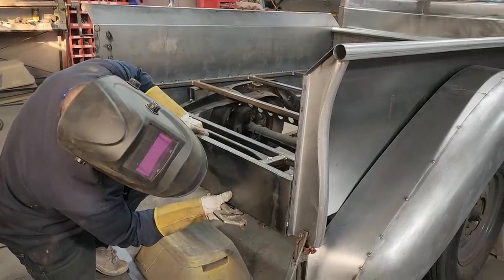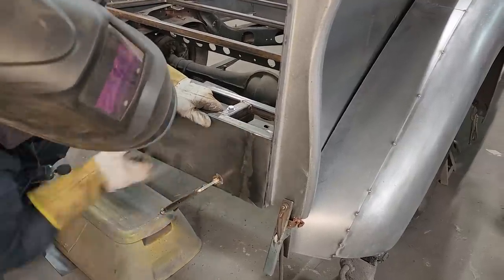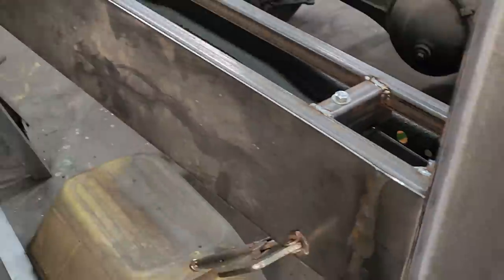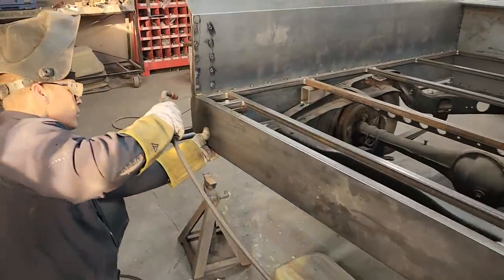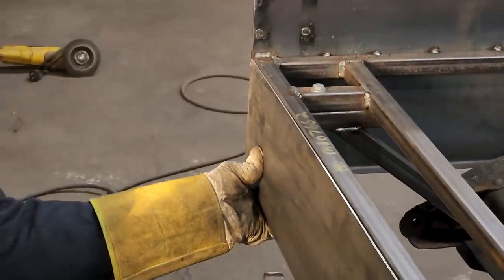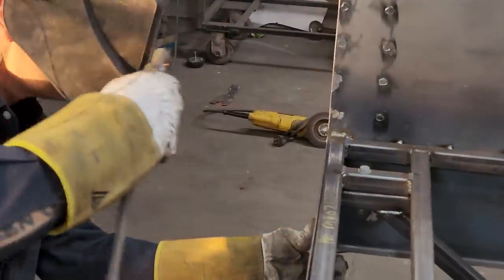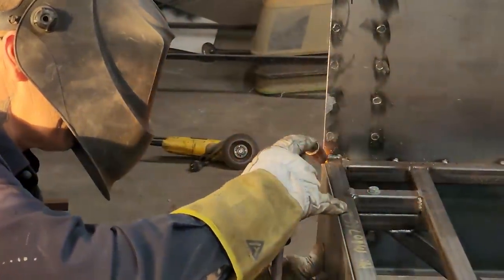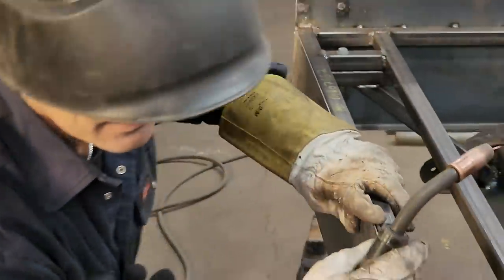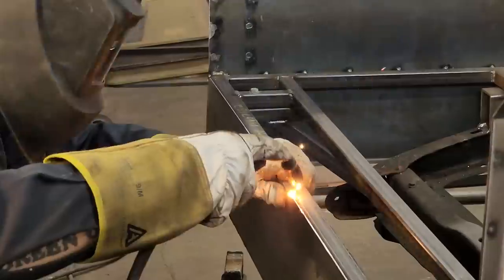I think it's gonna be perfect, so I'm just gonna put it on where it needs to be on this side. You can see where I'm down at that edge where the weld can go in there nice. I'm down on that roll there a little bit. I'm thinking that's the perfect place to weld it. I'm actually going to start from this end because I'm holding this end. Usually I would start in the center, obviously, but I'm feeling like I'm in the right spot. Just going to tack it. Let's go to the center. I'm feeling like it's right. Gonna work myself either way.